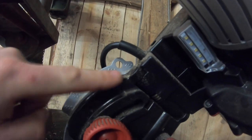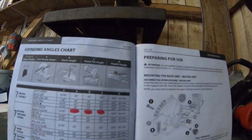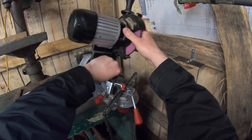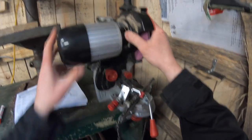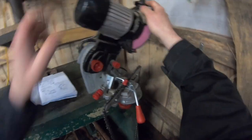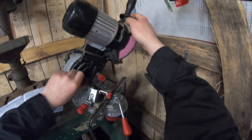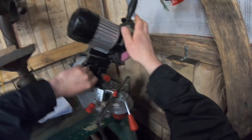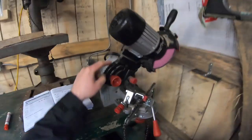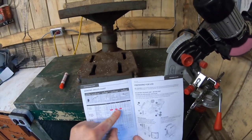Value C in the chart represents the head tilt angle. You'll notice a scale written along the back piece with a little arrow — this points to 55 degrees. To adjust, you loosen these two knobs and tilt the head from 90 degrees square all the way over to 55 or 40 or wherever needed. I'm setting it to 55, snugging both up, and the arrow now points to 55. Head tilt angle: check.